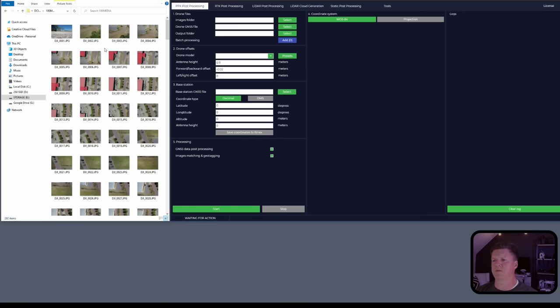And we'll talk more about this later because we're going to do some focus calibration and calibrating the focal length. You're going to see we really probably won't need it, but we still can calibrate that. When you let DroneDeploy change that during flight, or if you use any other app and it changes your settings throughout, maybe your ISO is changing, your aperture is changing, that is problematic. Because when you want accurate photogrammetry and accurate maps, you need the focal length to stay the same, because you're going to calibrate that focal length, and I'm going to show you how.